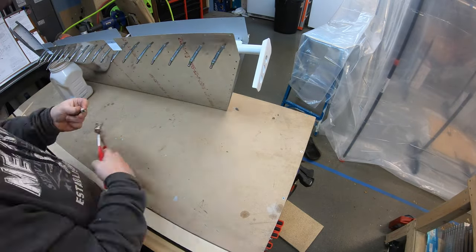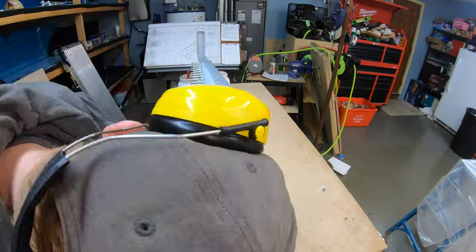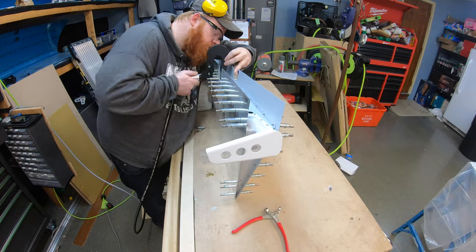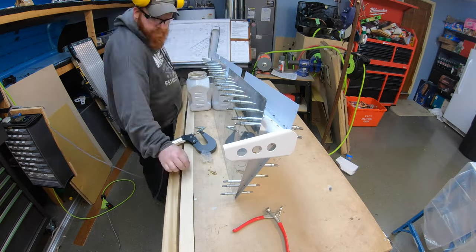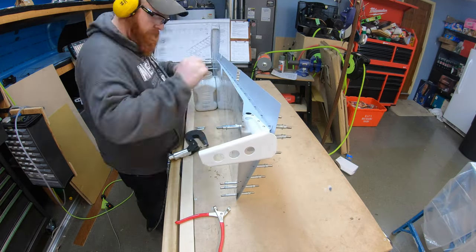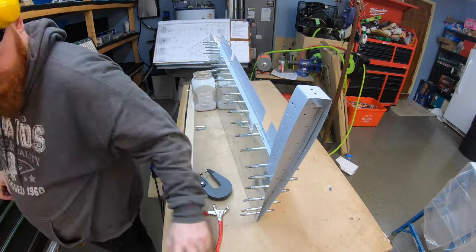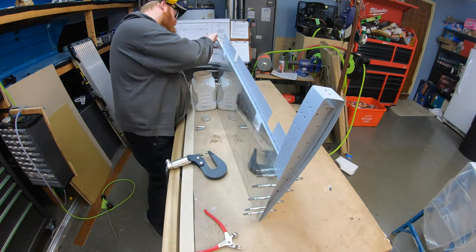From here on out, once you've got the spar in place, it's pretty straightforward. Blocking your view a little with my head momentarily, but very straightforward just getting the rivets in and setting them all the way with that pneumatic squeezer. On this row of rivets it really doesn't make a difference - they're all the exact same length, so no different than a typical pneumatic squeezer. You can see my right foot reaching behind me to the foot pedal. That's the one maybe awkward thing about it, but honestly it goes together pretty well and I'm getting pretty comfortable with it.